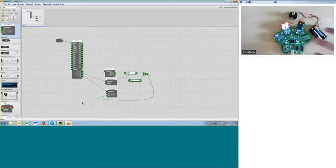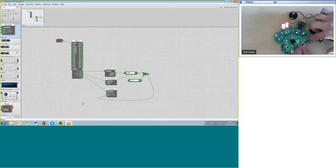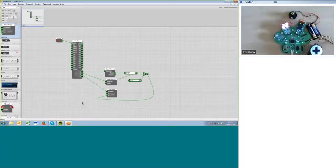So we could control all of this over the internet, because FlowStone can talk to the internet and your computer can, so it starts becoming Internet of Things and that kind of stuff, which is quite cool. Okay, so imagine this was a greenhouse and we wanted to open a window when the temperature went over a threshold. We could also do something like connect a servo motor, and if I just put that onto servo 0, hopefully you can see that,